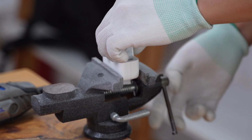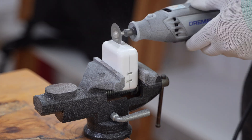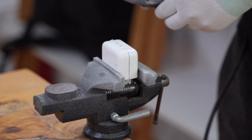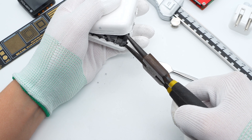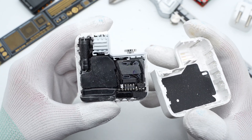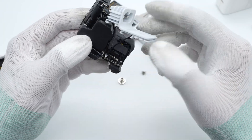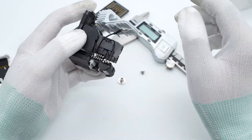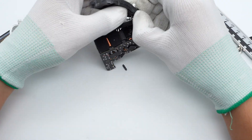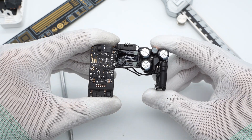After the brief test, let's take it apart to check what's inside. We use a cutting machine to remove the outer plastic. The internal components are covered with thermal pads for heat dissipation and fixing, and there is a graphite thermal pad for heat dissipation. Taking out the PCB module, the ground wire is fixed by a screw. You can replace a three-prong plug to avoid current leakage or electric shock. The module is divided into AC-to-DC and secondary step-down parts, connected through four black wires.